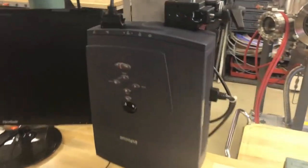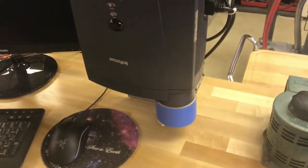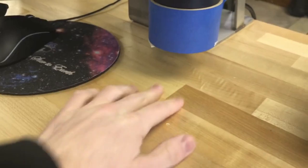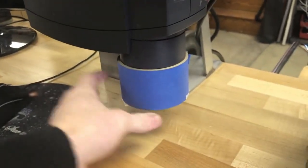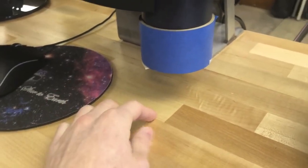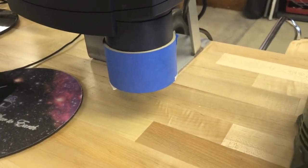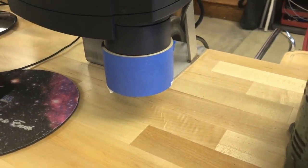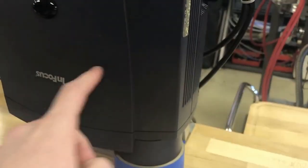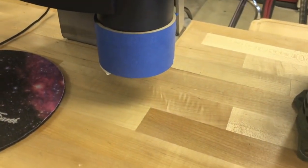This is how I'm patterning my photoresist. It's a not even 720p DLP projector, and it's on this mount so I can point it straight down. I put my substrate with the coated photoresist underneath this here. This is modified optics, so I can focus to a 1/2-inch by 1/2-inch square piece, and then I can focus down with that a line width about 50 micron, and then if I focus down to a 1/4-inch by 1/4-inch image, I can get down with this projector from 1999 to 25 micron line width pretty consistently.